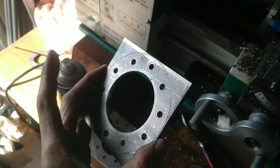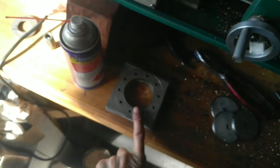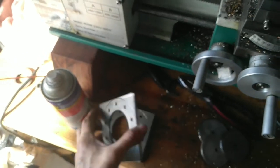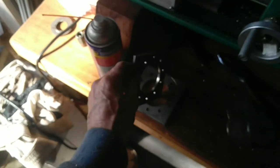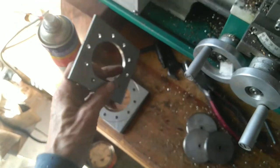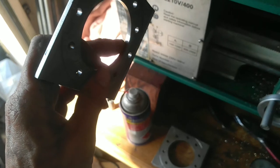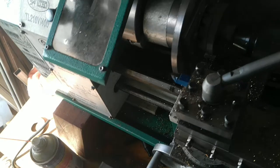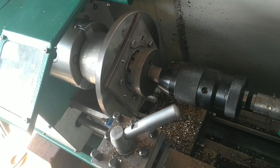These are cut to 62 mil, and the hole's got to be 65.5. The reason I've gone 62 is I want to try to taper that inner edge — I want to make it sort of wider at the front than the back, so it sort of follows the dome of the reactor and gives it a nicer finish. That's mainly why I've made this jig up, so I can do a better job of it.